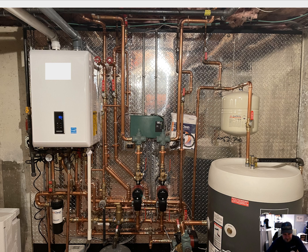I do not see a backflow preventer - no backflow preventer there. He's got two zones and it looks like two tees. Again the Grundfos Alpha setup - isolation flange on the bottom, isolation flange with purge on top - but the use of cast iron check valves is not necessary. One zone goes left, one goes right. It looks cool, looks nice. I like the diamond plate in the back. Then we continue along - I have a picture of that, let's go there next.